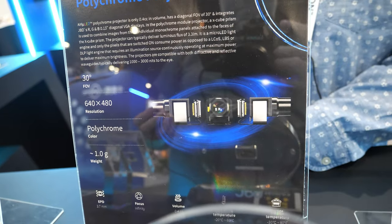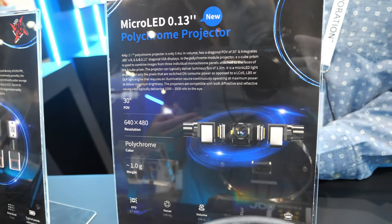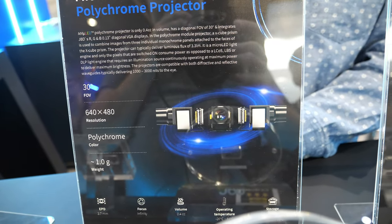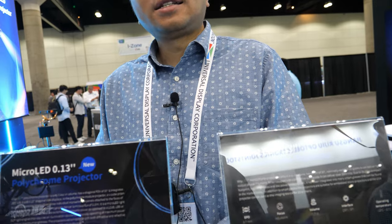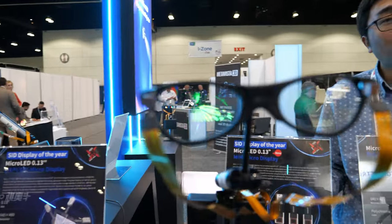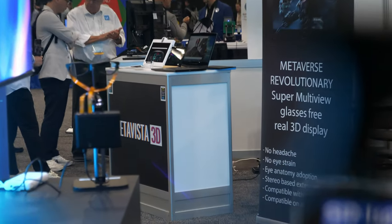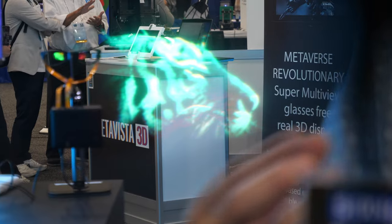So there's like some kind of prism with all three coming in? Yes, through the X-Cube — we call it the X-Cube Optics. It is basically an optical combiner which combines three colors into full color white. Is it very difficult to design this? It takes some effort to design it in such a small form factor, and it is also challenging to do the active alignment, because you need to make sure all three colors align well.